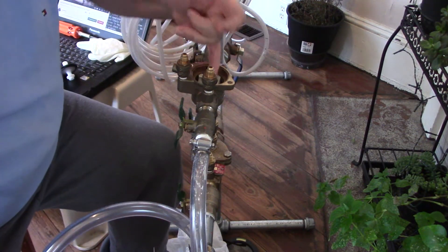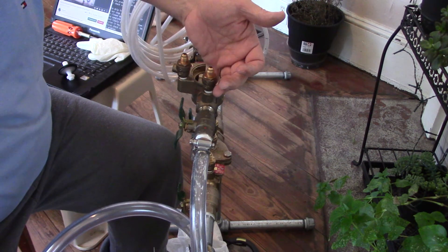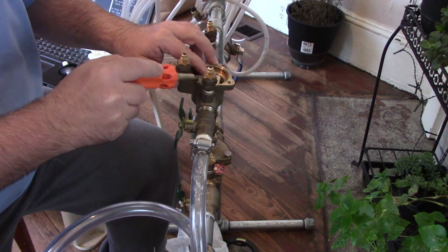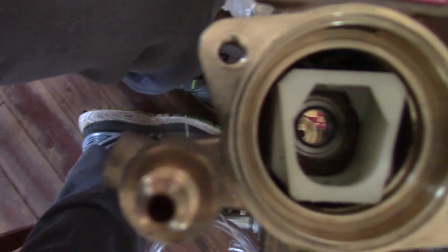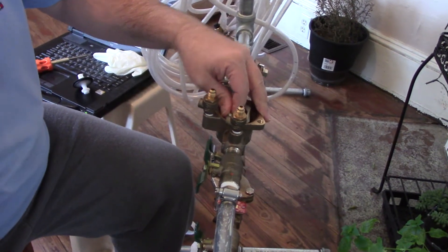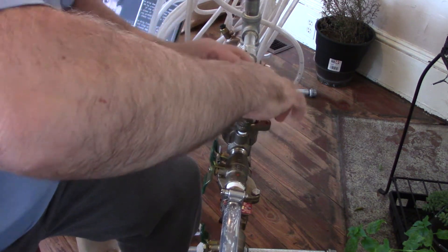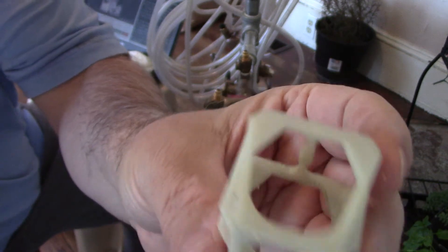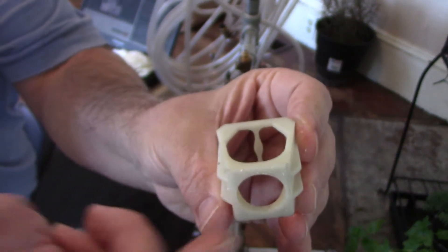I got it out. What I did was I pushed in the second check valve with my pinky, and then I used a screwdriver to gently pull up on this white piece and now it's coming out. It's just stiff — this thing's brand new, it's never been installed. Nothing like learning plumbing while breaking your own stuff. It's got some dirt on it; it goes in this side toward the second check valve.